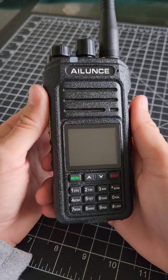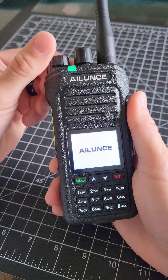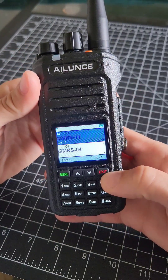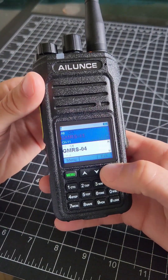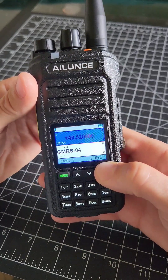We're having a look at the HA-1G and how to put it in VFO mode. Quick and easy, we're going to fire it up. Here we are. Click and hold the exit button on whichever band you'd like, and you're going to get VFO mode.